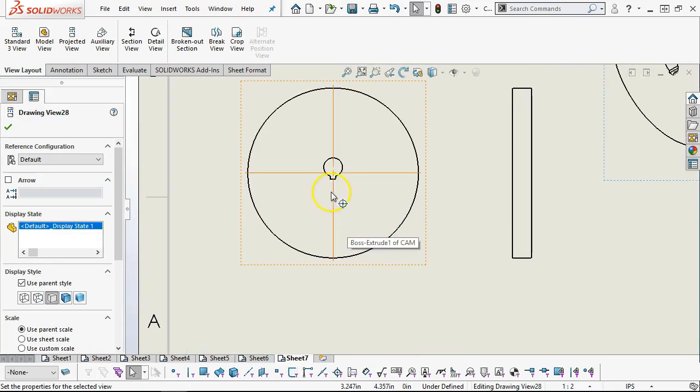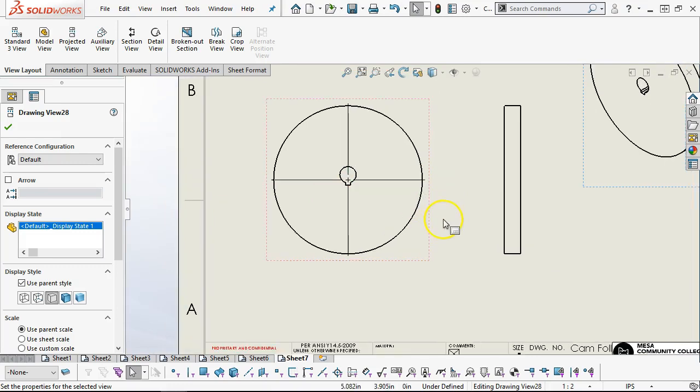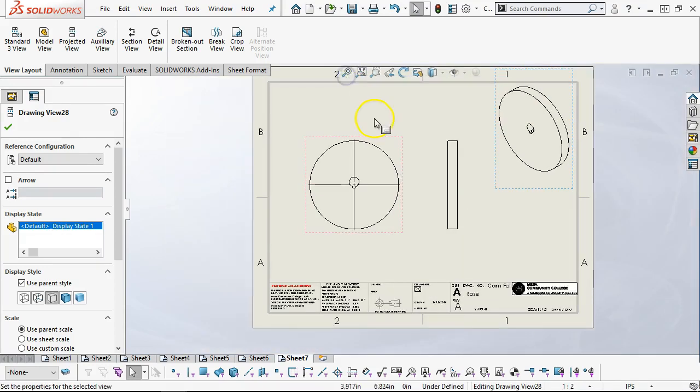So we'll need positional tolerance for the keyway, the location of the shaft, and a fairly tight tolerance to guide the fit for that geometry. The outside, it's still basically circular, but this is some place that if this were to be modified, if we were adjusting the motion of that cam of the post, then we would want to look at this as a surface of profile. And so we'll treat it as the surface of profile in relation to the shaft and the geometry.